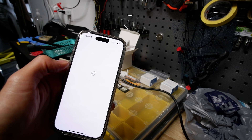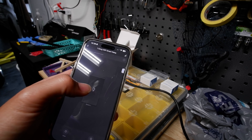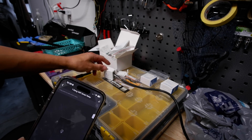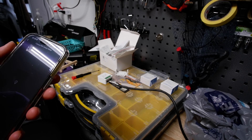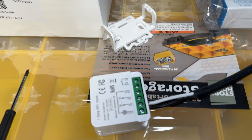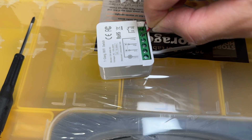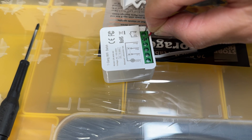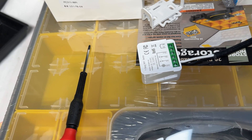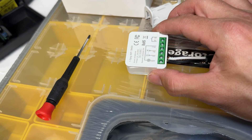While it sets up, it takes a few minutes on this setup screen. I can hear it click on and off when I test it. One other thing I want to test is the dry contact — I'm gonna get a jumper and see how it works. For the dry contact, all it really needs is an open and close — that's the whole point of a dry contact, it doesn't need any voltage. Put the jumper on and it switches on and off. In SmartThings I'm going to have it so any time that switch comes on, it gives me a text and a warning that there's an alarm on the panel. These devices are pretty common on Amazon, like seven to ten dollars each, and they work really well.